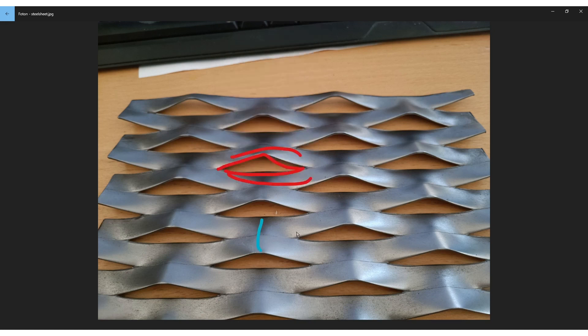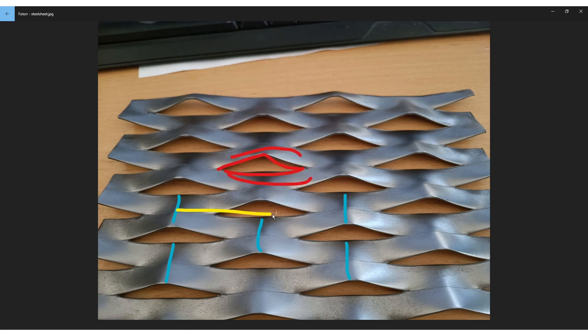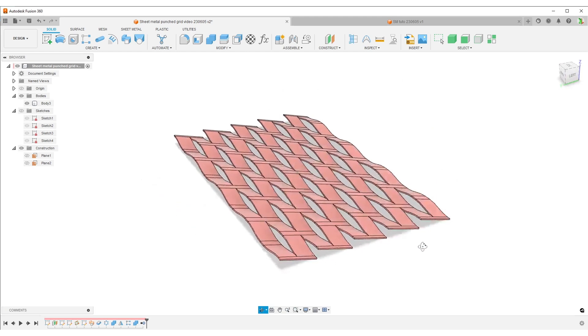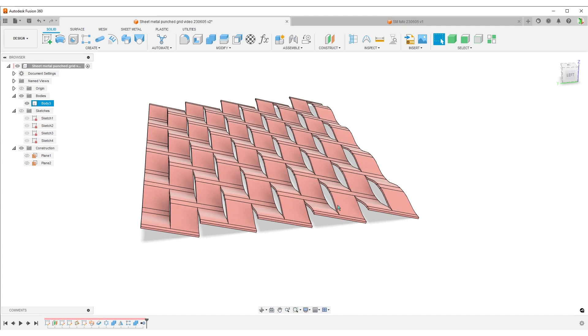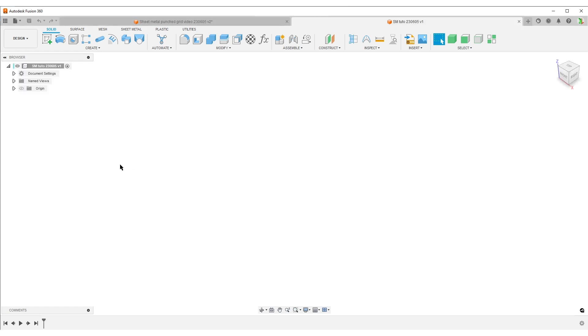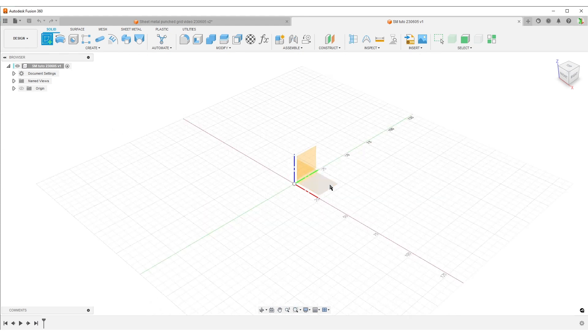Let's have a look at the other side and the design intent. You can see we have some axes over here. My design intent working on this - I will start by doing a rectangle. The rectangle will represent the shape in between here; this gives me the pattern distance and everything, it gives me all the paths needed, and I will model only one of them. Here's my model - I'm trying to make it parametric, where my definition of parametric is not just naming the parameters but having parameters drive the design, so I can change things and everything updates.